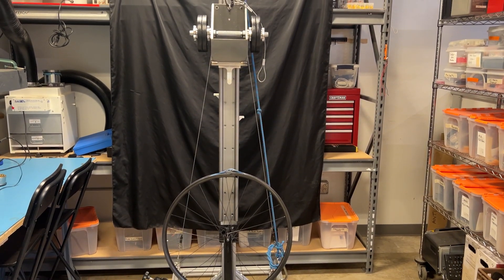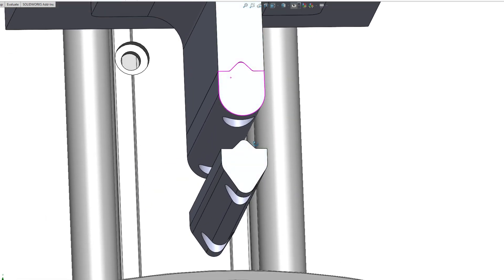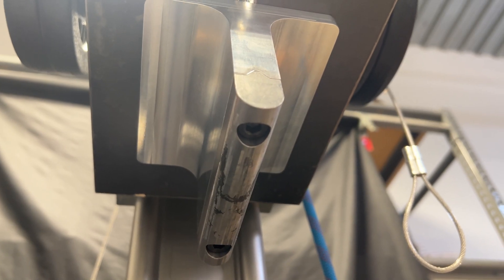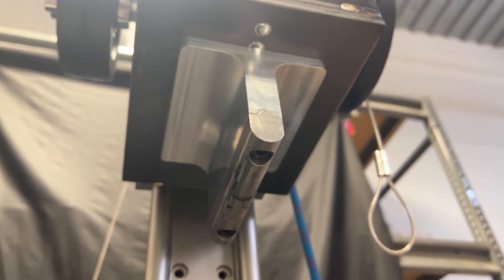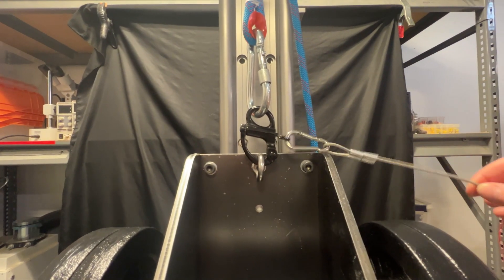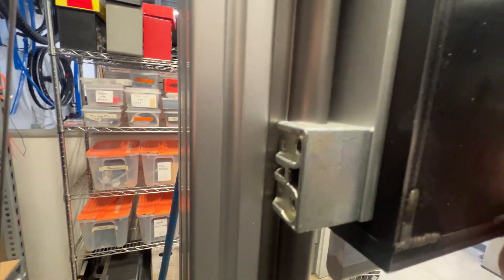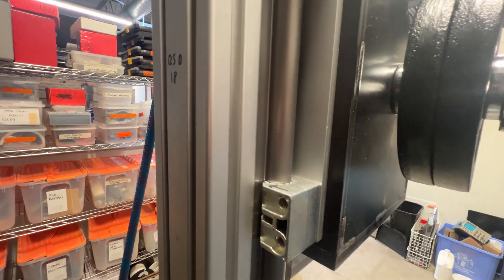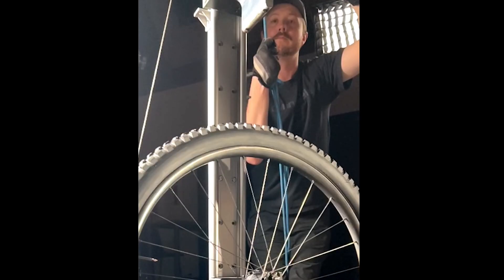And here we have it — here's the whole impact machine. It's very adjustable. We want to make sure that we could adjust the impact heads themselves and adjust the location of the impact heads, so this anvil can move fore and aft — away from us and towards us — so that we're hitting the rim in the exact spot we want. There's also adjustability in terms of the weights we can add and take away from the system. We have this quick-release pin mechanism that allows for a nice and consistent release of the impact sled. We opted to go for a linear rail bushing-type slide system, because it's consistent and doesn't have ball bearings that may break down or act differently over time as they wear. There is inherently more friction in this system, but the idea is that it should be more consistent over time.